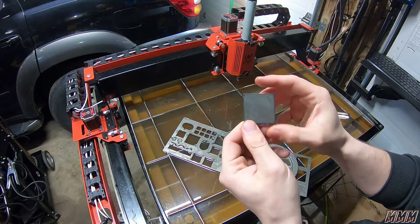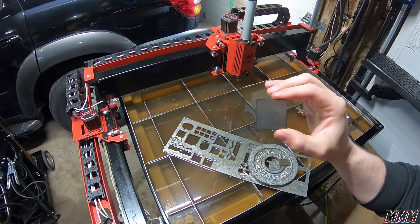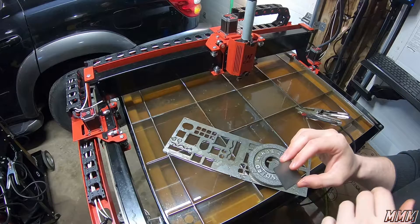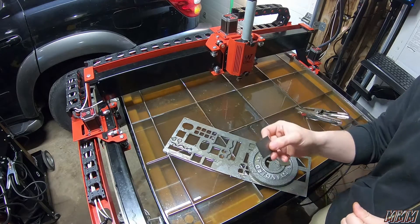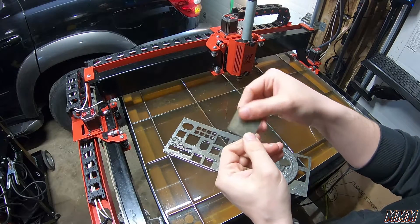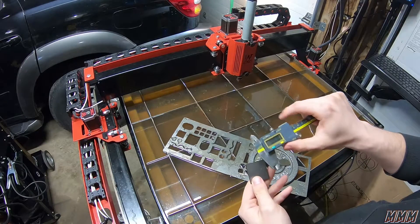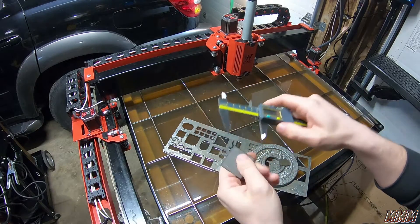Here's our square — it looks great. I finally figured out the issue with it pausing at the end. I had to set a rule in SheetCAM to not turn off before the end. The rule was: before end, distance zero, feed rate 100% — so it goes all the way to the end of the lead-out and then turns off. Hardly any slag on the end here. Let's measure it — should be an inch and a half. Wow — one thousandth. Very nice.